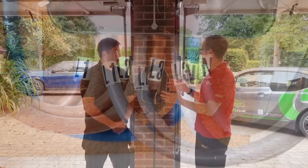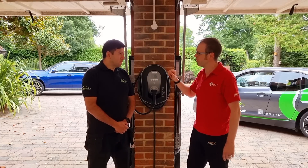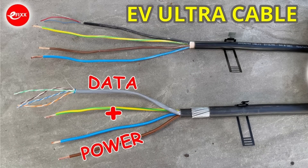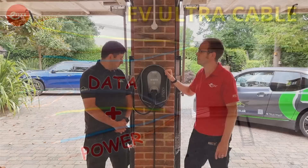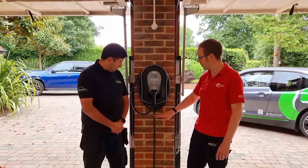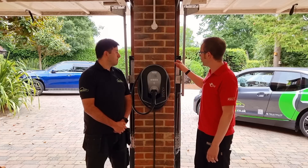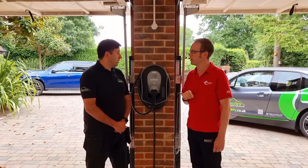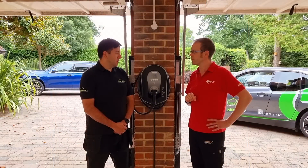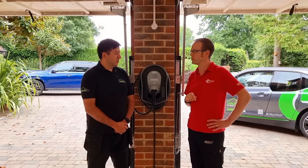So with that three-phase supply coming in, you've said that you've run a separate ethernet cable. What type of cable would you normally use on a project? Do you prefer a separate data cable or a particular brand? At Joltify, we try and make everything look as best it can be — and not just look, but be as best as it can be. We tend to use EV Ultra cable, non-SWA, which obviously contains the ethernet cable. We also pair it up with the Linean Fire Clips and the Linean Super Clips, which gives that really nice neat finish. In this case though, we couldn't use that EV Ultra cable because we've got the main service head in a different location to the fuse board. So we didn't want to go into a junction box and split it just to keep the aesthetics neater. We've neatly tucked the ethernet cable behind the five-core power cable and run it directly to the service heads, and then the power cable back to the fuse board, which helps to keep things a little bit neater and more inconspicuous.